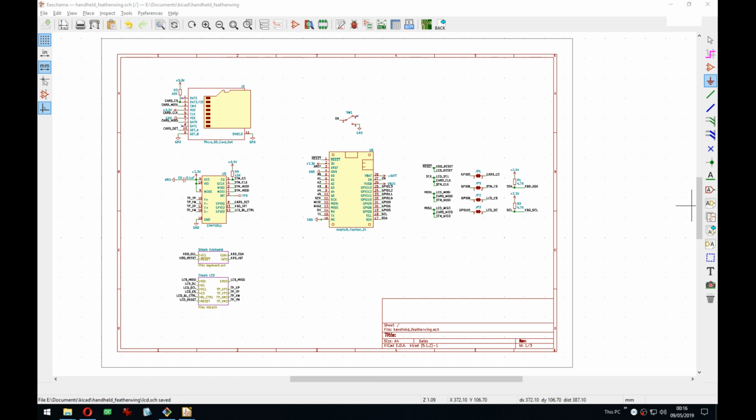And then we have the global switch. Header with double headers. Because on the back, what's on the back? The card, yes. The feather, yes. And the battery, yes. Then you can disconnect pretty much everything. Yeah, because the MISO and MOSI won't matter. There's no CS, so they should shut up. And each CS you can disconnect, and the DC. Yeah, you know that this might actually be kind of it if we don't put the SPI flash on it.